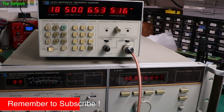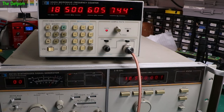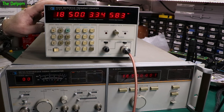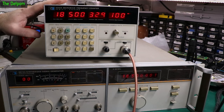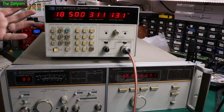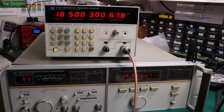I'm going to leave this running for a little while and let it settle down, and we'll see what we get. Interestingly the power has increased to 192 watts by doing the higher frequency, or maybe it's the power output which has done that — I'm not sure. This is also quite a nice check that this thing is actually working, because I repaired it a few years ago and had no way of testing the higher frequencies. The most I could do at the time was about 2.7 GHz.